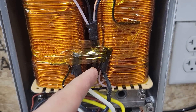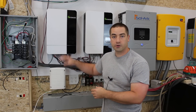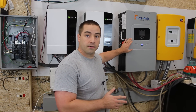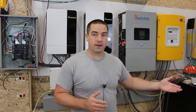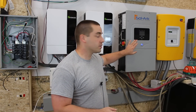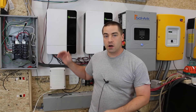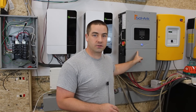Some people have asked why go with the Sol-Ark at all - it's almost $7,000 and you can build the setup with the auto transformer and two Growatt inverters for under $3,000. Well, there are some features in the Sol-Ark not available in the Growatts. The primary one is back-feeding: if you have a net metering agreement with your utility grid and want to send power back onto the grid, the Sol-Ark can do that. It has the UL listing for it and the back-feeding ability. These Growatts are really only meant to be used off-grid.